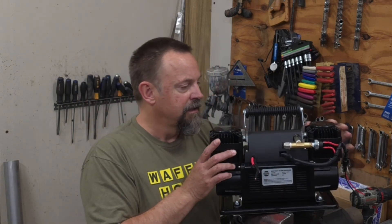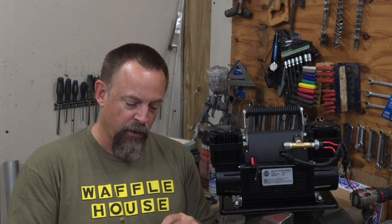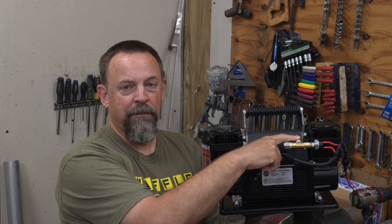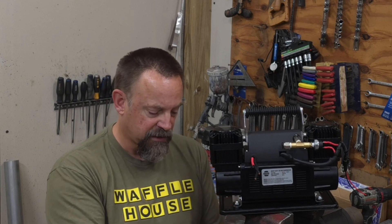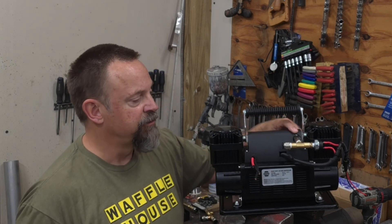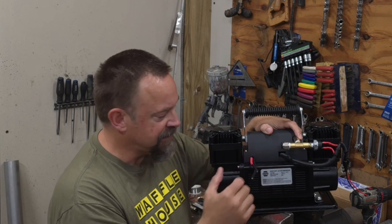This compressor came with an eighth-inch NPT fitting and quite a bit of hose, but it has an oddball quick connect that won't fit anything else. A lot of people will take that eighth-inch NPT fitting and drill out the header — the tube that goes from cylinder to cylinder to the output — and tap it to a quarter-inch NPT, because the eighth-inch NPT has a very small hole that is a big bottleneck in airflow. You get considerably more flow by drilling it out. I've done that modification and connected it so I can run an air tube to the tanks and also put a pressure switch on it.